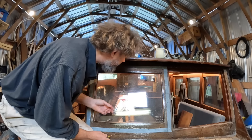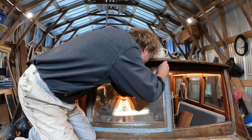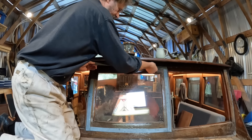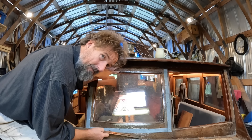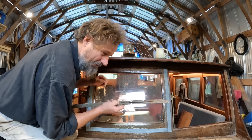The center window is sealed in, so it just means lots more screws and I have to deal with that. That's why we use a reasonable sealant and not an adhesive. This is 291 — it's a great sealant and you can pull it apart.